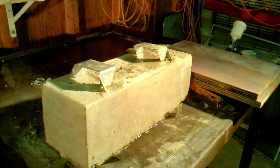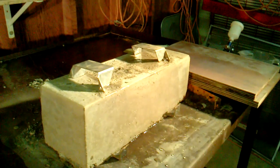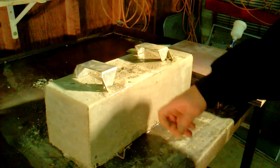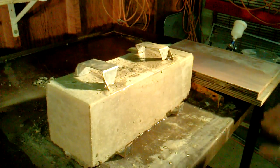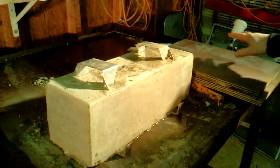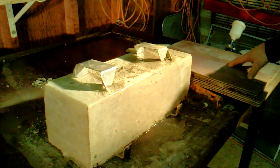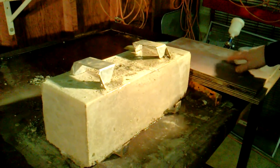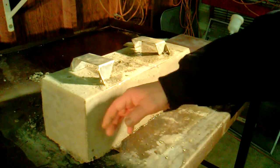So: three-quarter inch MDO, 2,500 PSI concrete from any hardware store. Did a pour. Liked the edges — they rounded up. Concrete came out water resistant. Edges look really good and the panels fell off clean. I think if the forms were new or at least cleaned and done right, someone doing nice architectural concrete could get maybe 3, 4, or 5 pours out of one coating of this product. And it's going to give them a nice clean wall — I mean, this is really smooth. It's not even stung and it came out really nice.